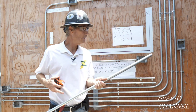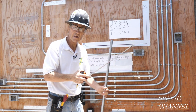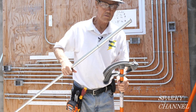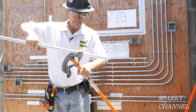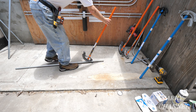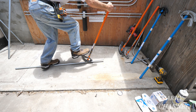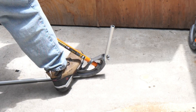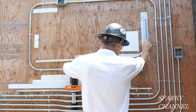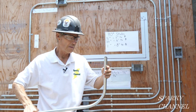Here's three-quarter-inch conduit, and we're going to be making a 16-inch stub. This time we subtract off six inches — six inches to arrow — so we make our mark at 10 inches. We made it at 11 inches with half-inch conduit; now it's 10. Grab a three-quarter-inch bender and put the arrow right on the 10-inch mark. Step on the back of the conduit with your left boot if you're right-handed, and put your boot on the heel of the bender — nice and smooth. Here's the three-quarter-inch 16-inch stub we just bent — maybe an eighth of an inch short, but pretty close.